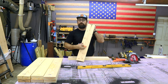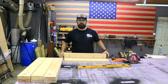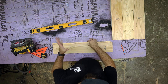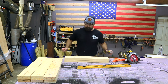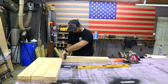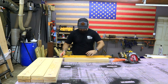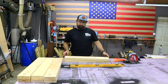All I'm going to do is take a straight edge and line that up and strike a mark. This is going to give us the taper that we want on one side of the leg, and we need to have it on the second side as well. I'm going to set the board next to the other board we just marked and trace a line on that — the reason being we're going to cut off that roughly one-and-a-half-inch section so this will look symmetrical on both sides. These are going to give us a template for the other six that we need to cut, so once we get these cut out we can just trace them onto the others. I'm just going to go ahead and use a straight edge and the circular saw to make these cuts.